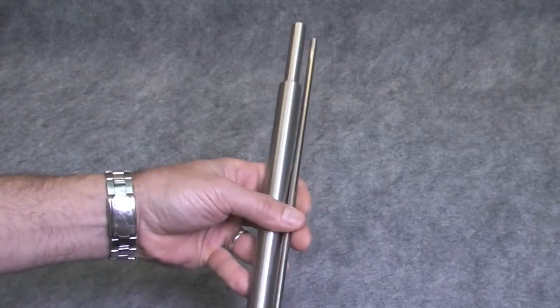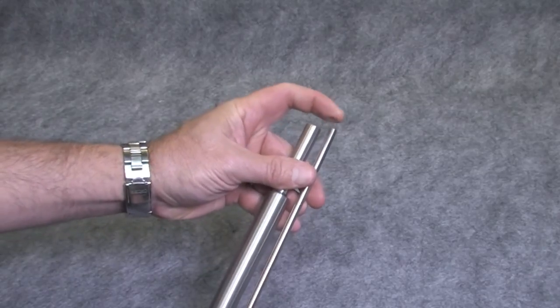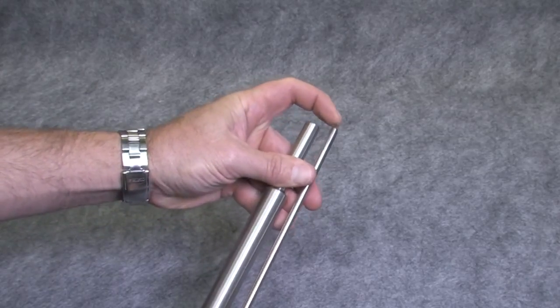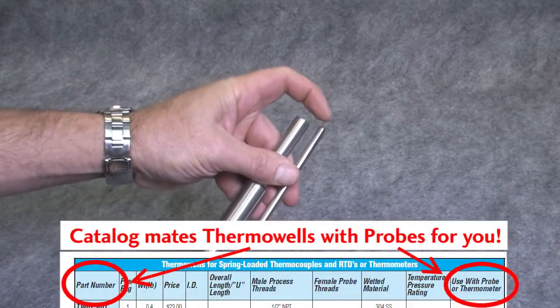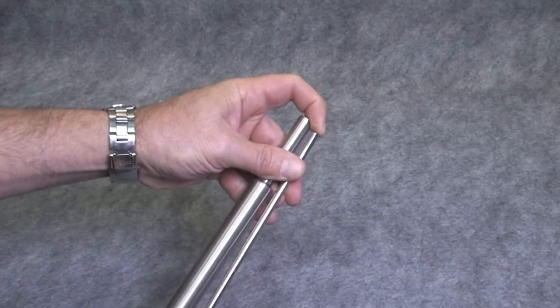In this case, you'll want to use a spring-loaded sensor head with a probe that is a little longer than the depth of the thermal well. So when you screw the probe in, the spring presses the probe firmly against the bottom of the thermal well, giving you the best possible thermal transfer and the most accurate readings.